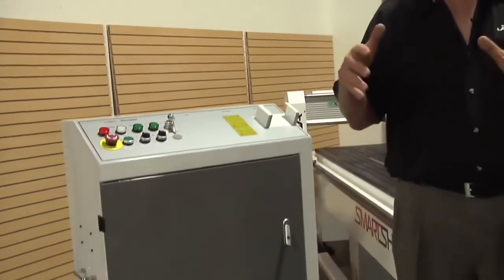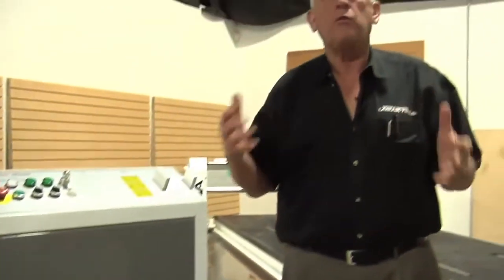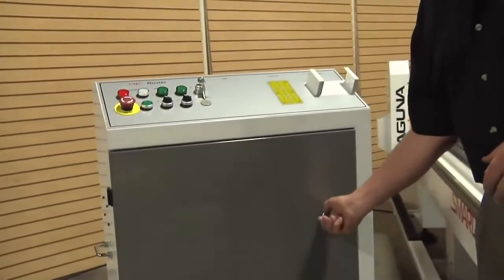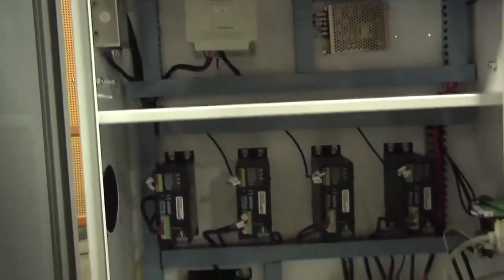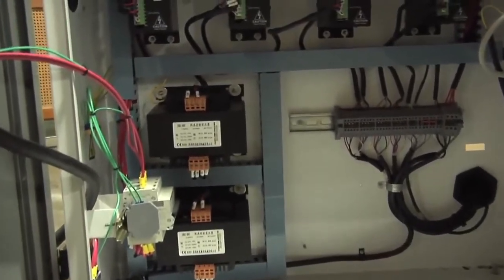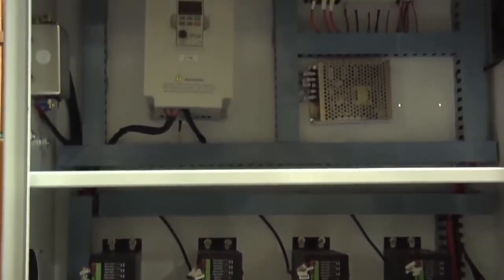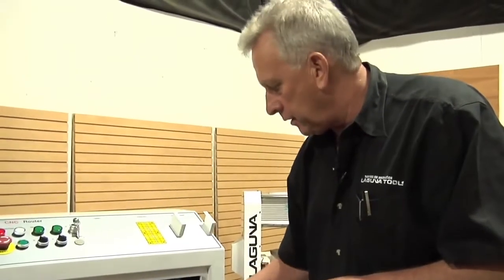One of the characteristics of the Smart Shop machines is that we put the electrical components in a cabinet severed from the machine frame. Why? It's vibration — we want the components to be away from the normal machine vibrations that occur when you use the machine. Let's look inside this cabinet. One of the things you look for when really looking at machinery is: should there ever be a problem to diagnose, are the wires numbered or labeled? If you notice how neat all the wiring is in the cabinet — we're very careful at Laguna in our assembly factory to make sure that's correct, because you may sometime need to diagnose a component and you need to know where the wire goes. Those numbers correspond to the schematics.